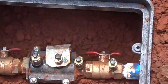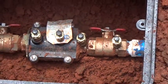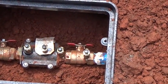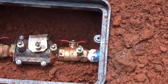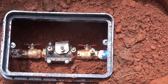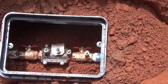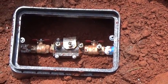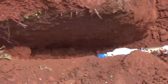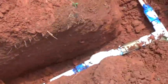In order to do that, you need to put in a backflow preventer. Several companies make them — Watts, for instance. This is a Double 007 model backflow preventer. It's got two shutoffs and two check valves in a valve body that needs to be tested once a year according to code. That valve prevents you from feeding non-potable water — as declared by city ordinances — back onto the city water line.